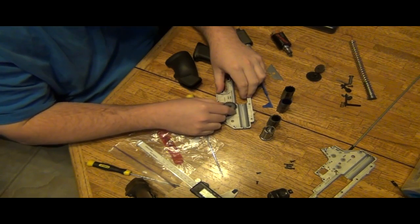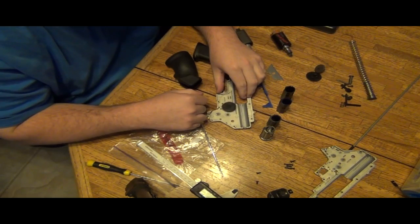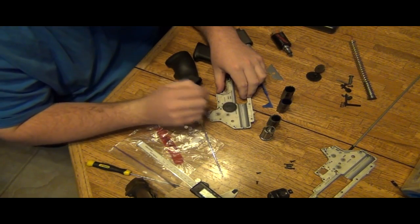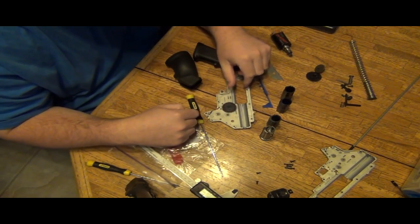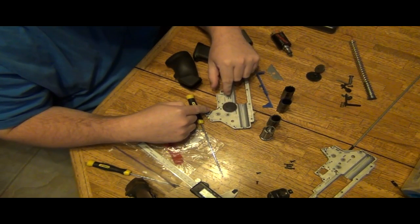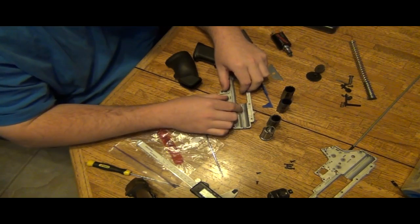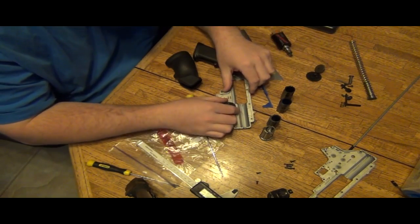You want to make sure that there's a lot less material for the gear to touch, just the bearing or the bushing and not the gearbox. Plus, you also want to make sure it's parallel. See, look at how much that spins. It's outrageous. It's still going.